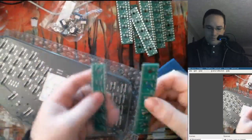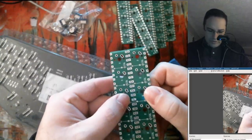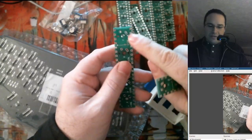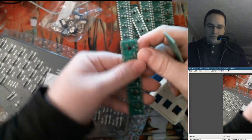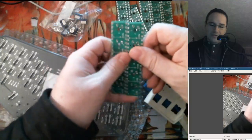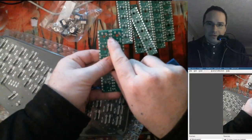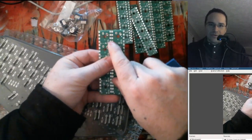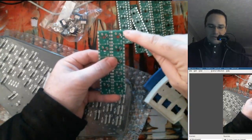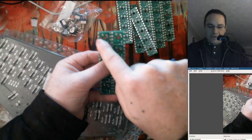Vertical boards. So anything that's ortholinear, you can set. Oh, look at that. Nice. So all of these are your rows going across for this switch set, and you can match that with another switch. When you solder this bridge across here, this switch will be connected to this switch on the row. And that way you'll be able to solder over here straight to your microcontroller. And you won't have to solder here and here and here and solder between the switches.